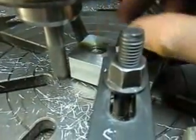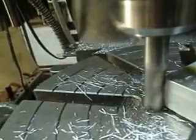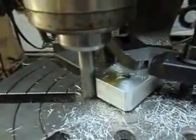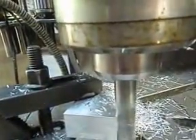Put a bit in and go ahead and start cutting. We dialed in our center, then pulled the table back this way so we've got a little clearance, and now we're going to pretty much work our way back in to the piece, chewing off all the excess that we don't want or need. Let's go ahead and do the other side and then we can put this camera down. We're just going to keep working our way in until we get a complete half circle.